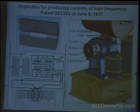And what was also curious about this unit, the pancake coils, you can wind them in different ways. And in all of these coils, there were kind of a drum with the outputs coming out on either side. And the problem with that is there was a huge tendency of these middle windings to want to arc to each other, because this was where the highest tension was obtained.